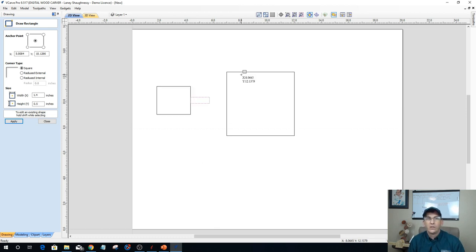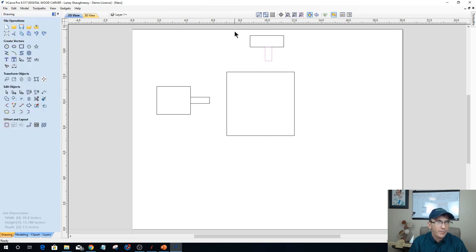You guys and girls with CNCs that have your fourth axis mounted to your bed at the table, your router would be coming down from the top. Either way, let's look at it from a side view just for illustration purposes only, but it comes in from the side. When we are zeroed out, we are all the way towards the left end of that cylinder, either right at the end of it or a little bit in from the edge, wherever you want your X to be.